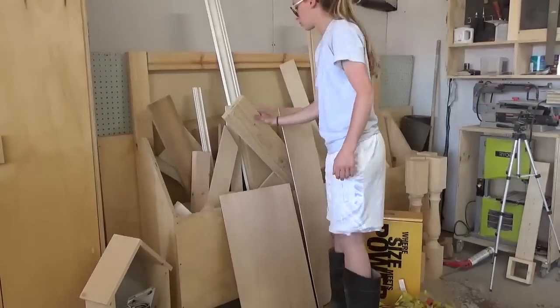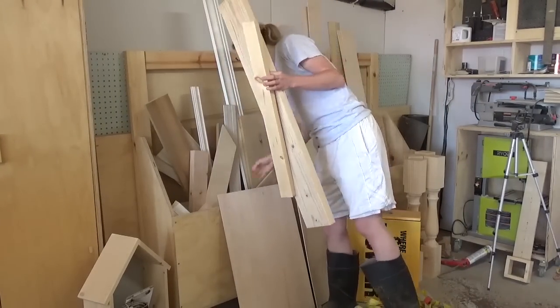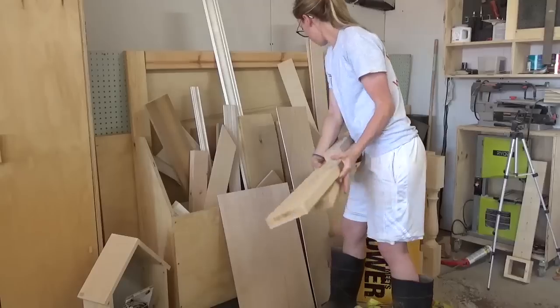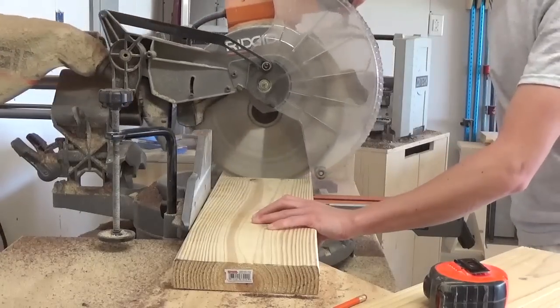For this project, you'll need a cool chunk of wood for the middle of the clock, a stick of 3/16th inch by 2 inch steel flat stock, and an eye bolt. You'll also need some scrap 2x lumber to make the jig to bend the steel. For this, I raided my scrap wood cart for a few boards.